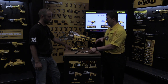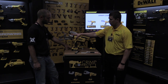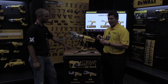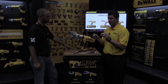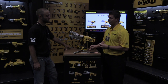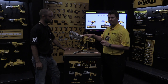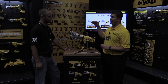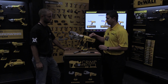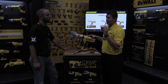This is our 12-ton U-type die crimping tool. Our tool will accept any manufacturer's U-type dies — these are the different dies that go into the head of the tool. There's a different size die for every size of connector, with 16 different sizes. This tool will crimp anywhere from number 8 all the way through 750 MCM copper or 1000 MCM aluminum.